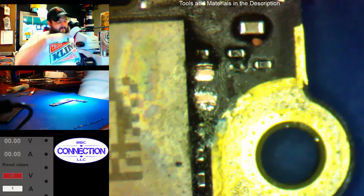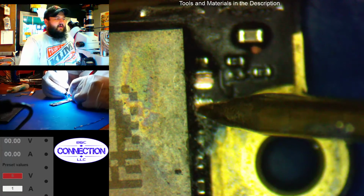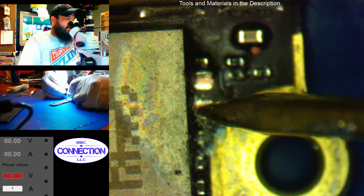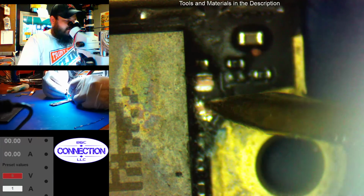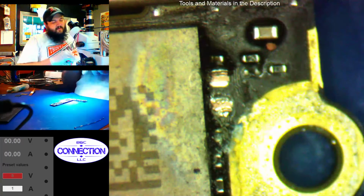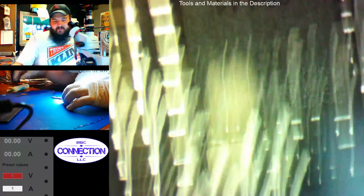Alright, so we've taken that off. Let's do a diode reading to ground now. So red probe there. Alright, so after removing that cap, we've come up from 0.185 to 0.217 and climbing. Let's retest again. Okay, we're at 219, 22, 21. Okay, so it's climbing, but I still don't trust it. So based on the amount of corrosion around the NFC chip here, I will be pulling that one. And first I'm going to clean that area up though.